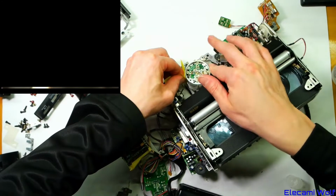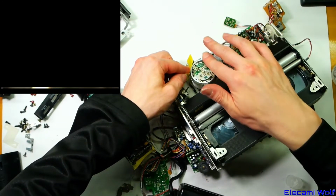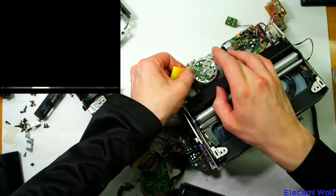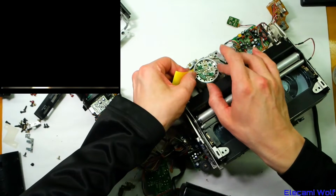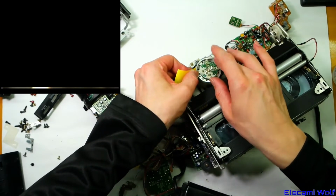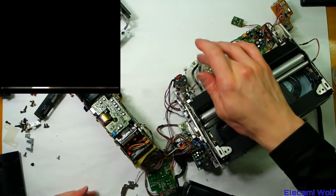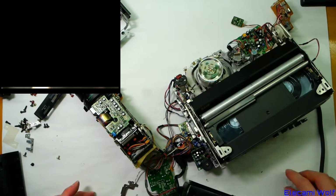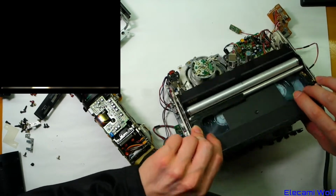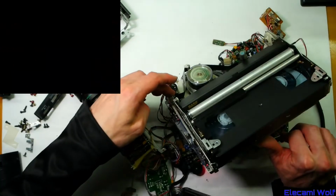If you're not careful when doing this, you can snap off the video heads. So hopefully we haven't done that. That's why you just hold the paper still and rotate the head. Don't move the paper around because that could break off the little video heads. It's getting there. Let's try it out, and just make sure it's dried before you start it up again, otherwise the tape will end up sticking onto the head, and it doesn't like doing that very much. Better.